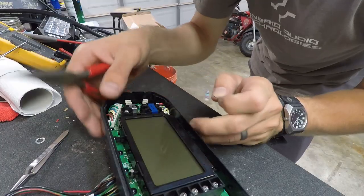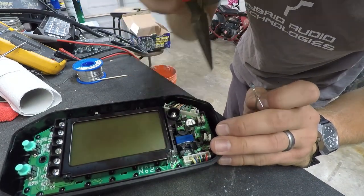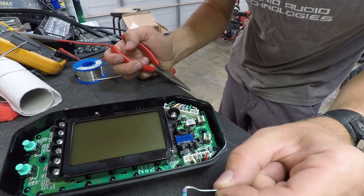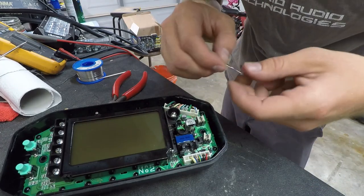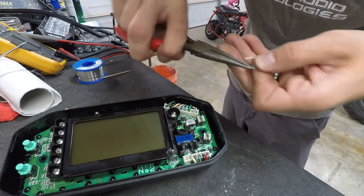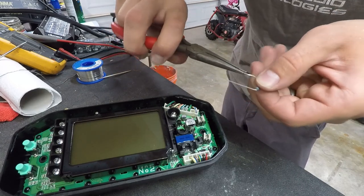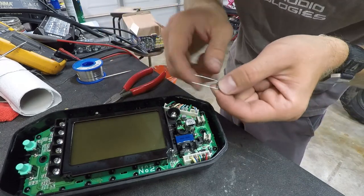I'm not going to go through the trouble of ordering a surface mount resistor because I have a high-current through-hole style one. The way this board is laid out there's plenty of room for it to tuck away safely. There shouldn't be a lot of current flowing through these leads so it shouldn't fall off. Vibration may be an issue but I think I can attach a blob of silicone to help it out. I'll make a nice neat little package.